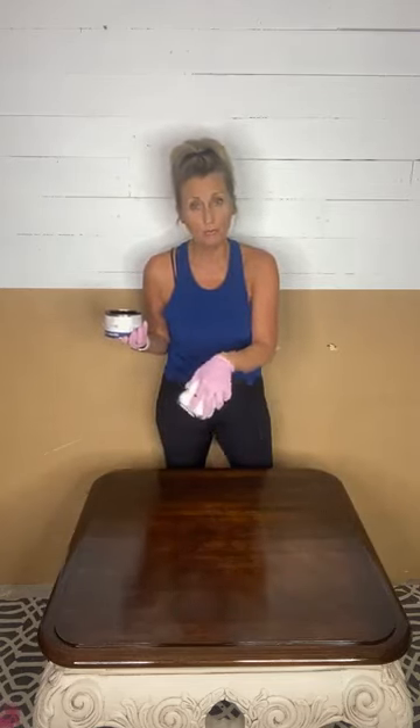Diane is saying that painting is the only way when the watermark is deeply through the wood. I just think you should try to stain it, see how you feel about it, see what she thinks. I'm shocked at how good that looks, and I didn't even sand it back — I just rubbed it with 220-grit sanding paper. Yours will probably turn out great.